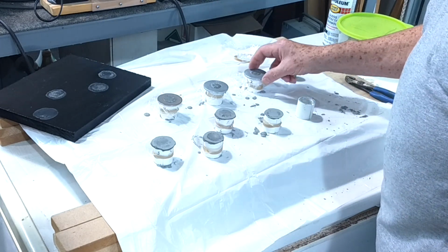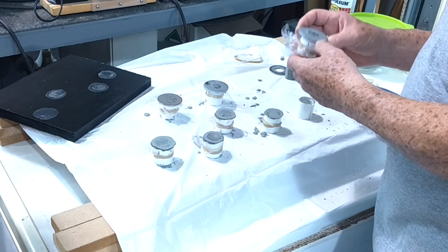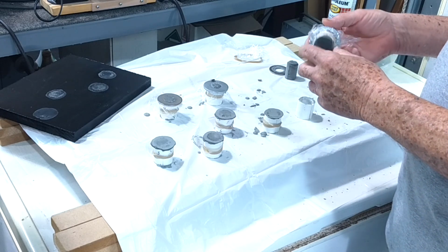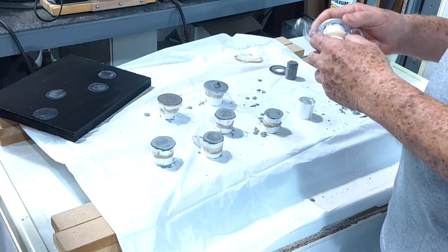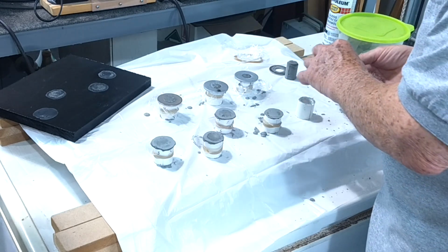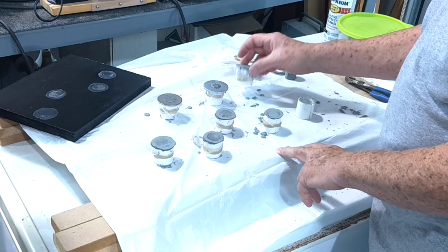Now, when I used the 1.88 to 1 on the 2-inch samples, I had the water running out through the cracks and so forth. So I got a comment from a guy named Skyak, why not hold the molds together with cling wrap? I couldn't get it to hold the molds together, but at least I got it to seal the molds better. Now I thought it was going to slump anyway, so I put these washers on top so that I'd have a little reservoir of material in case it did slump away.